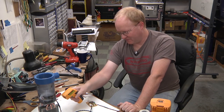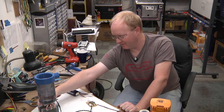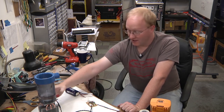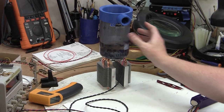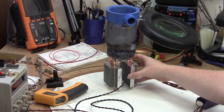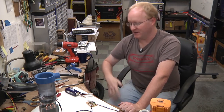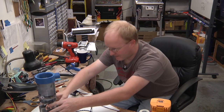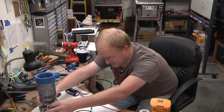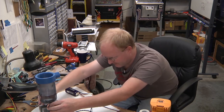The heat pipes are above room temperature, so heat was definitely being transferred into them. Yeah, I can feel the warmth. The idea here basically is the heat is pulled from the water into this heat sink down here, then the air can blow it away. And this is some hot water that I microwaved just so there'd be a noticeable difference. But in the case of camping, you would just take regular water and make it colder than the surroundings.